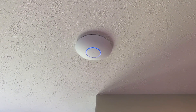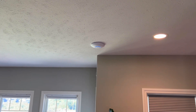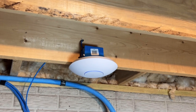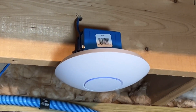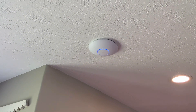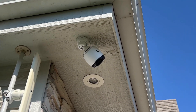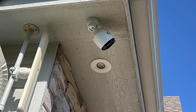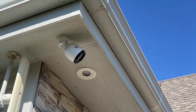This is an example of an access point I have in my house — a ceiling-mounted Ubiquiti U6LR access point. Underneath this access point is just a single gang box like you would install for a light switch, with a single Ethernet CAT6 cable. That is what gives this power and its network connectivity, and that cable runs all the way back down to where my network head-end is and plugs into my switch, which allows this device to get online. The next thing is one of my Ubiquiti cameras — on the other side, running up through the eave of my house, is a CAT6 cable that runs through my attic and drops down to where my network head-end is and is plugged into my switch, so this camera can get online and record events that happen in my driveway.